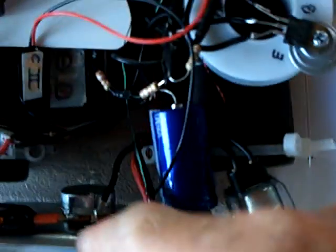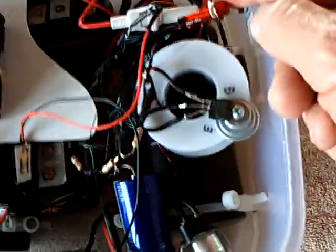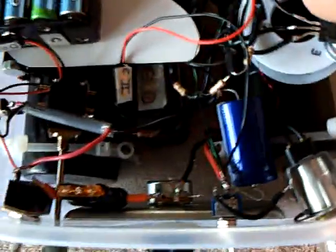The rheostat is another thing you've got to watch out for. I have a heat sink in there for it, but that gets warm too. Those are the only two things you've got to watch out for. I got a little neon here as a safety device on the transistor, but I haven't seen it glow yet, so I don't think that's necessary. And I fused it with some fuses here too.